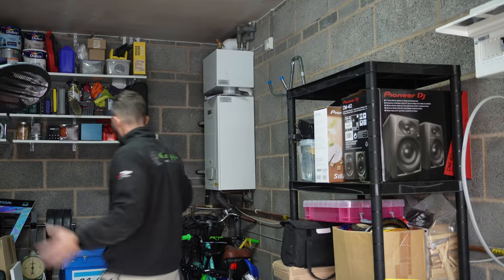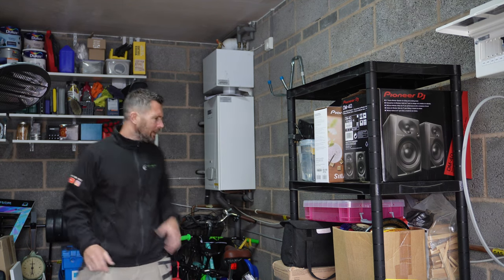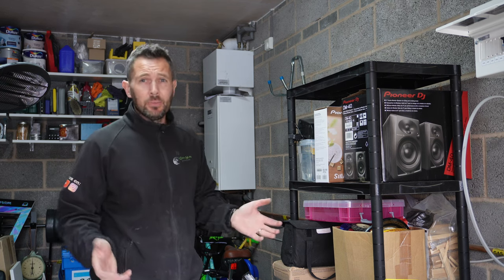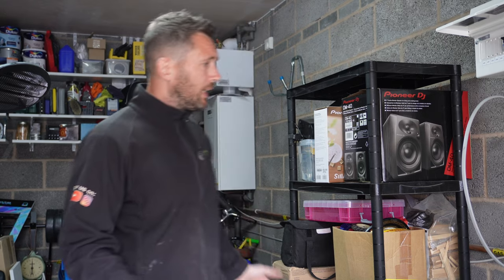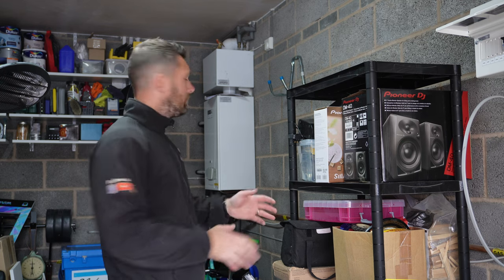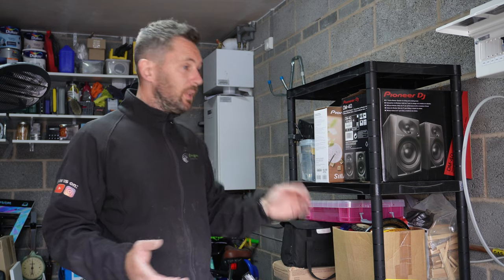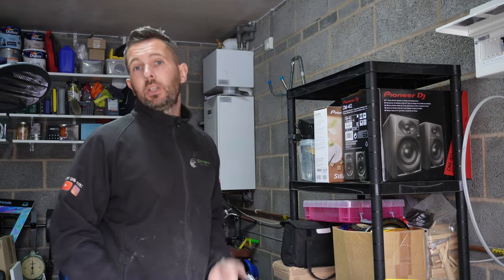Okay, so cables ran round now, so we'll clip that through. So we'll put some fire sealing on the back there. So clip direct, which is exactly how it sounds, is clipped directly to the blocks. It doesn't have to be in anything else, doesn't have to be anything jazzy, don't have to have mechanical protection on that because it's all exposed within, obviously, the garage and things like that. So you can clearly see it. You don't have to put it in trunking, all that sort of stuff.